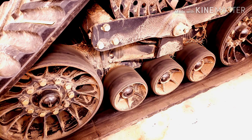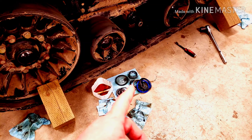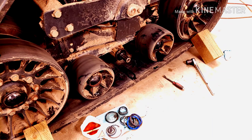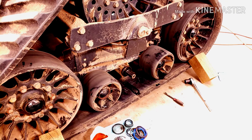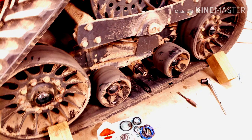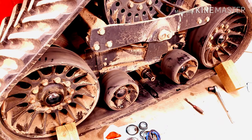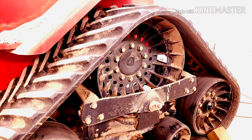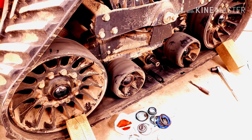For those of you who might know something about these quad track tractors, there's kind of a problem with them. As you can see, we've got bearings on the floor, we've got a bare spindle in between two track frame mid rollers or bogey wheels, depending on what you want to call them. It's this bearing system all along the track frame here. These bearings fail often — there are five we're showing here, there's another five on the backside, which makes for 10 at one corner. There's four corners, so there's 40 of these bearings altogether, and they're failing often, sometimes within 500 hours.